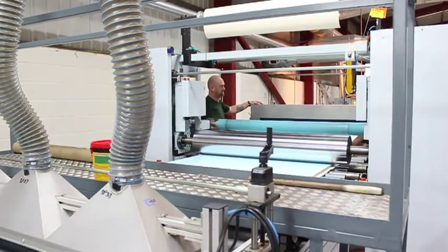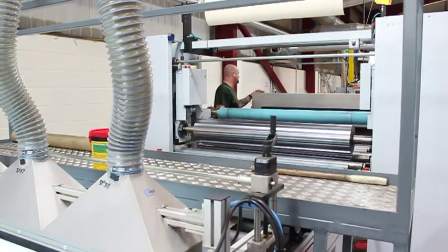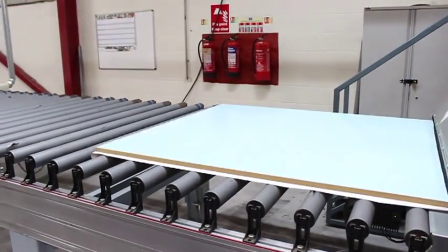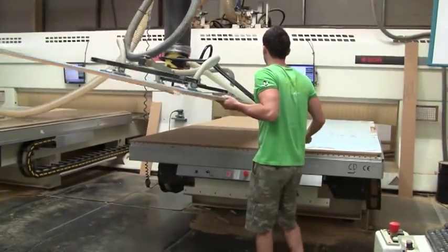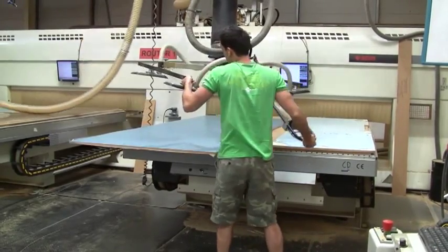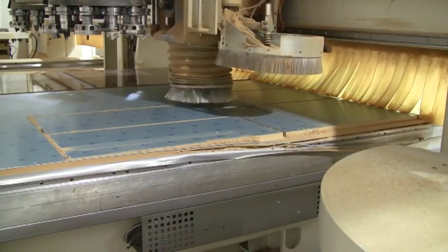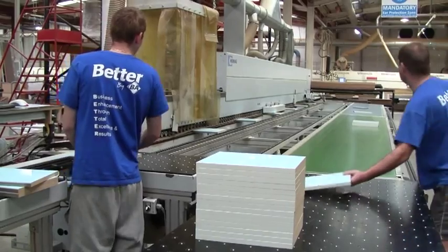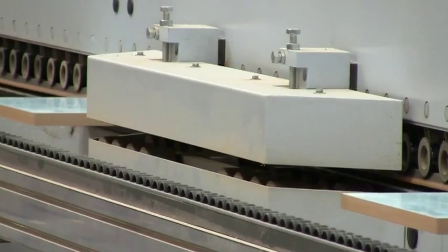Pressure is applied by use of a series of rollers, and after the foil has been allowed to cure, the sheets are turned over and the acrylic sheet applied using exactly the same cold lamination process. The acrylic sheets are cut to door size on a CNC router where a sophisticated optimization program ensures the best possible use of each sheet. This is known as a nesting process, and doors of different sizes can all be cut at the same time. Glass Effect 3D ABS edge banding is then applied edge by edge to all four edges, ensuring the unit is completely sealed.